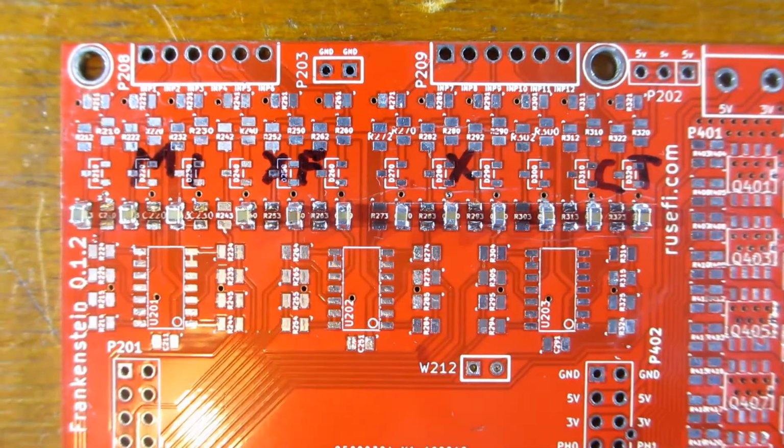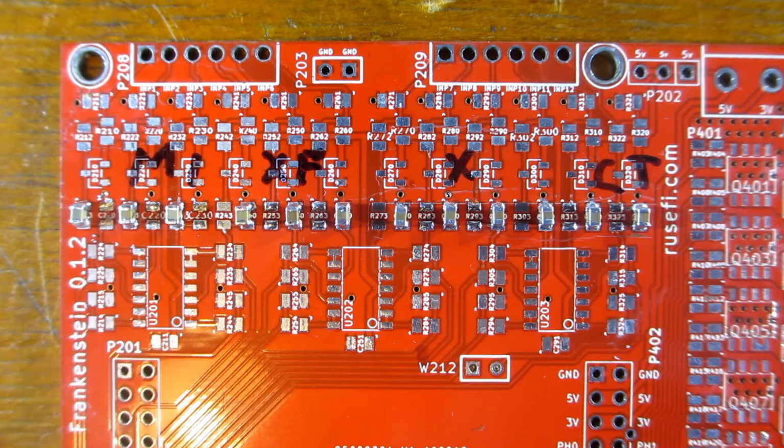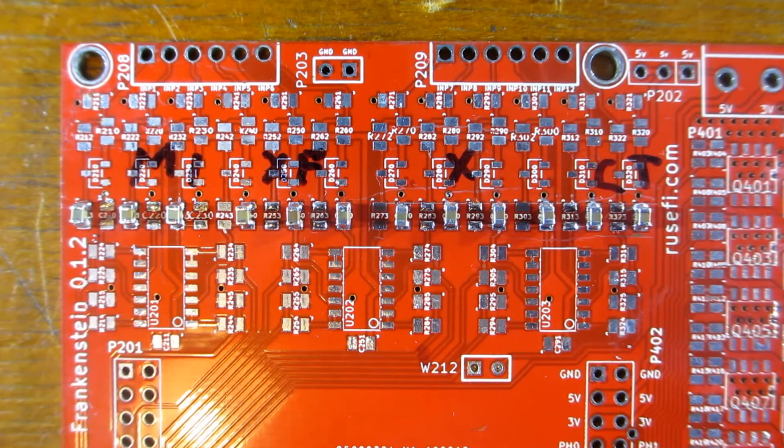Well, that didn't tell me much, but if I was pressed I suppose the Redux is a bit better. It wicks the pads better and seems to have a higher volume of solids. Basically the higher solder and less flux makes a fuller joint.